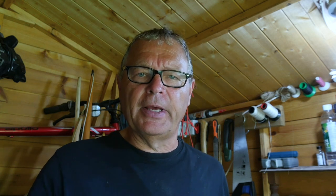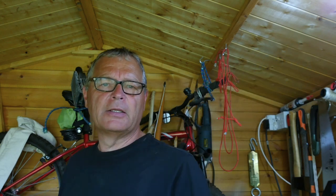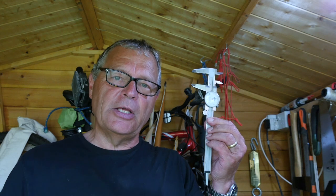There are many other useful little pieces of kit — aids — that are really handy when you're making a bow. An aid is something that just makes the job a little bit easier: it can be a jig, a vice, or something you've made to help you along. I've been able to find many aids to bow making in the home and the garden shed. Really useful is some means of measuring and marking — I use a tape measure and just a pencil. Occasionally I'll use a steel rule. By no means essential but handy if you can get one: a vernier gauge or carpenter's calipers, really useful for measuring the depth and width of your bow and working out the tapers.